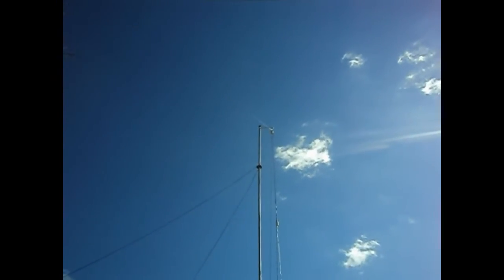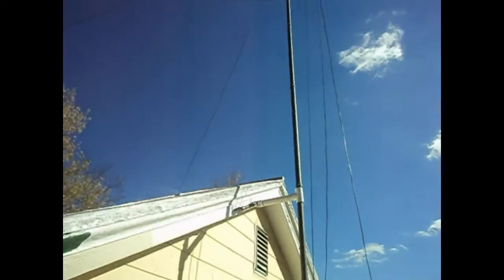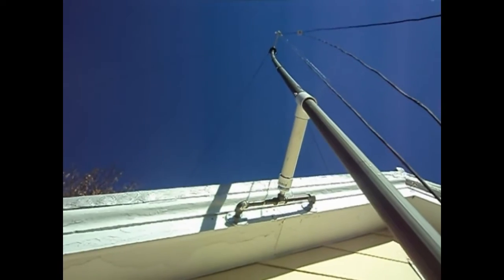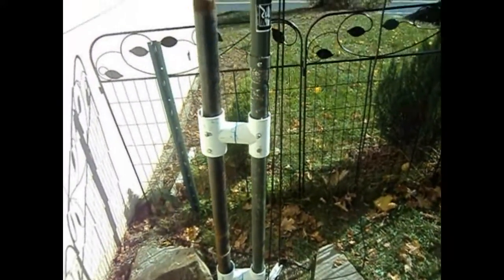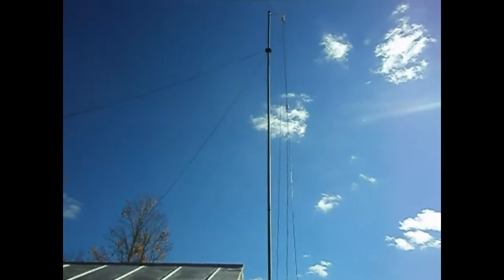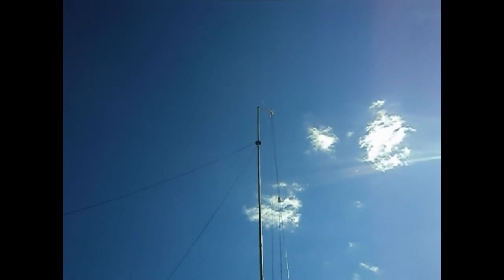That's the Maple Leaf Studios antenna by Bruce — great quality, well-built. You can see there's a balun about 12 feet down — that's my vertical radiator between the balun on the bottom and the balun on the top, and then the off-center-fed dipole going each way. I did attach to the house here and spread it out with some pipe. I initially had it screwed just in the middle and it was too wobbly, and it ended up pulling the screws out, so I put a T on there and spread that out. At the bottom we have PVC around each pole, screwed in with stainless steel — everything is stainless steel. Like a flagpole, I can raise and lower it with my pulley for maintenance. I didn't put any coax seal on those connections yet — I'm going to buy coax seal, pull it back down, and seal up all my connections for the winter so they're weatherized. This is Tom signing off, K2BEW.